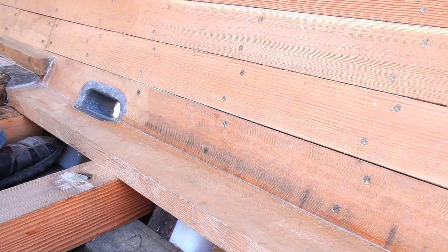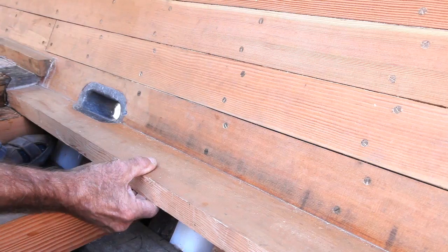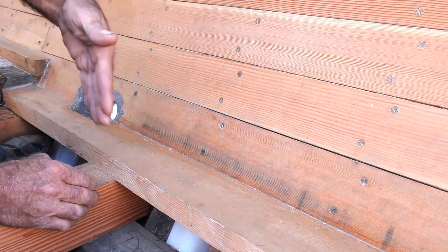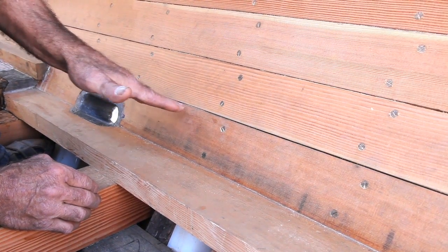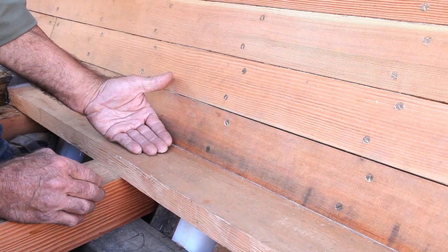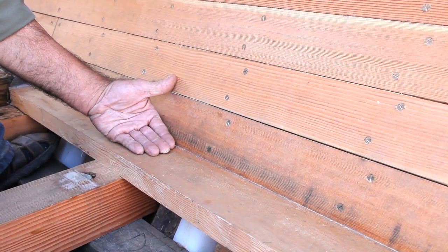It's still done in a traditional fashion and it's got nice beefy lumber. This is all quarter-sawn fir with the annual rings going vertically through the deck — 90 degrees to the sealant in this respect. This is a lumber that doesn't swell and contract a lot. It'll stay nice and tight, very durable, nicely done.